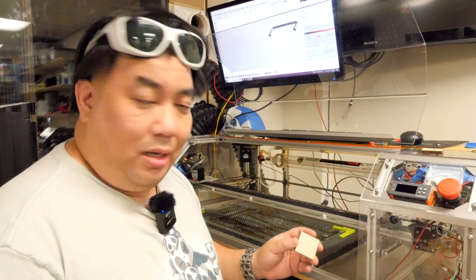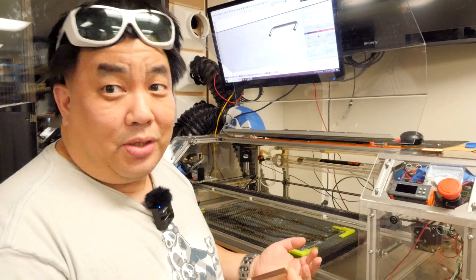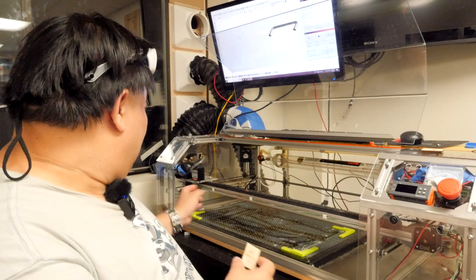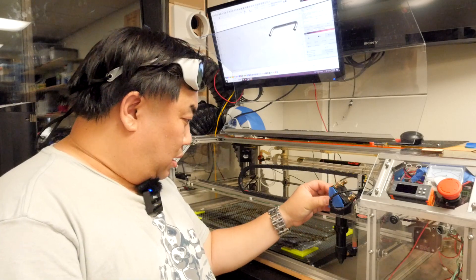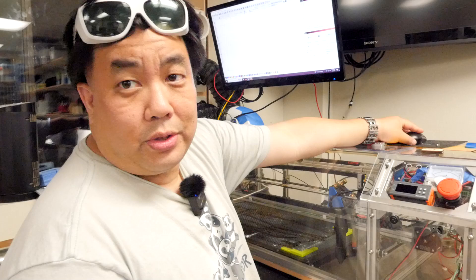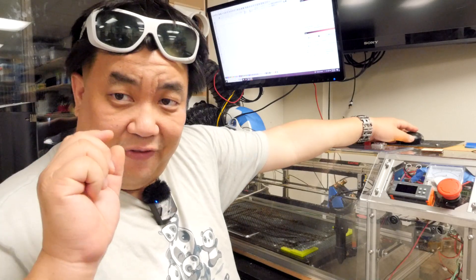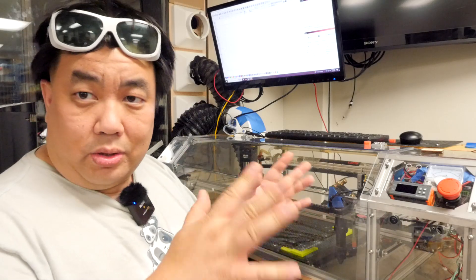The other thing that to me is nuts is traditionally people just use the test button on the back of the laser, and this fires basically an uncontrolled burst — you have no idea how much power that laser power supply is going to let loose. So I came up with a little laser-etched target that fits right on the laser housing. I've programmed into LightBurn a low-power laser pulse macro that will allow me to fire very short and very controlled amounts of laser energy to see where that burn mark is, and from there I can tweak my mirrors to dial the laser into alignment.